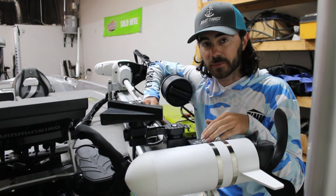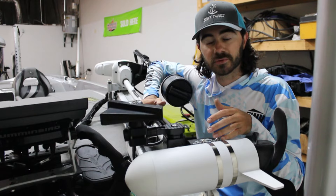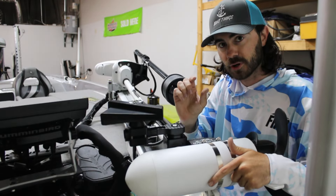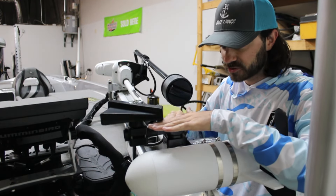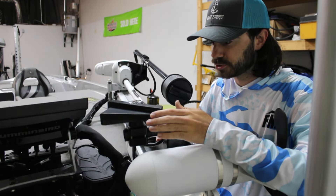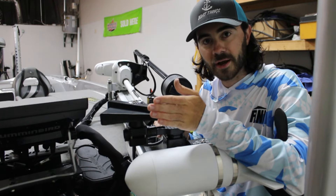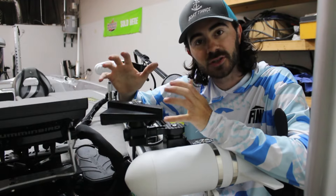The point of this mount is pretty simple — it replaces the stock bracket that comes with those LiveScope systems. This allows you to have a zero degree offset with your trolling motor. Your standard bracket comes at an eight degree angle, which allows the transducer to see past the trolling motor head, but this bracket offsets it far enough from the barrel that it doesn't need that tilt. This gives you a LiveScope transducer perfectly parallel with your trolling motor shaft and a true straightforward image on your LiveScope screen.